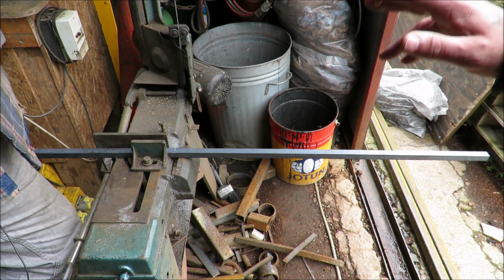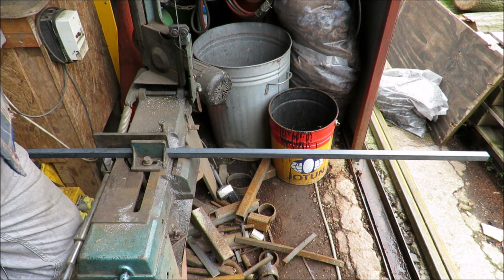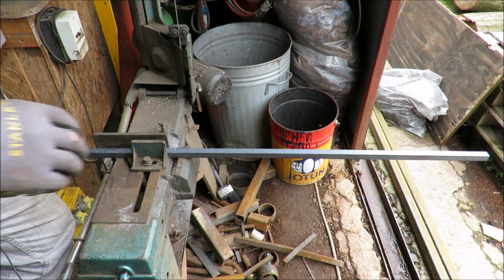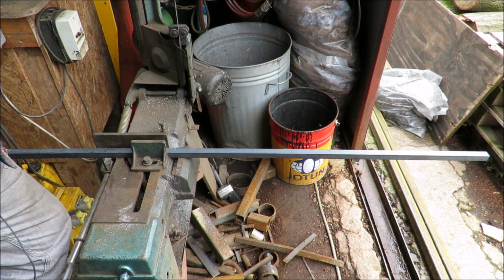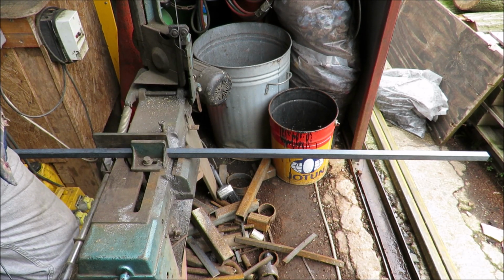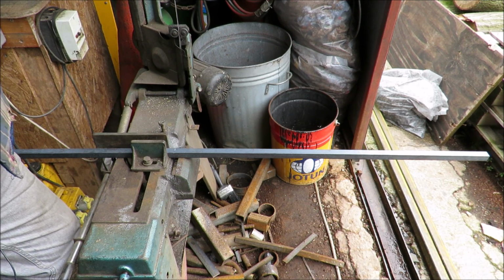So we're going to cut the steel now because we want it about 1 metre. Our total height is going to be 1 metre. Our block's 120, and because I'm useless at maths, I left that to you to work out. It's going to be 880, isn't it? Yeah. The way the jig works is, rather than make a ring on the bench and risk it not getting quite as flat as we want it, this is our finished height, and we build the frame inside the legs because the jig's good when it sits. So basically, we just got to get the cutting right now. So 4 880 legs then. Yeah, that's going to start us off nice, and we start putting them in the jig.